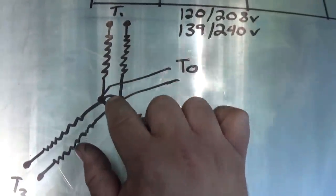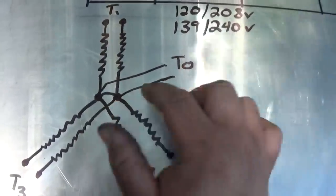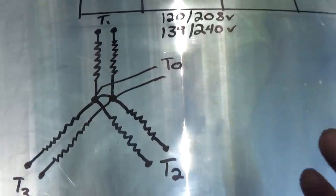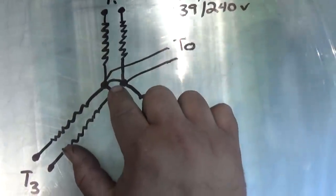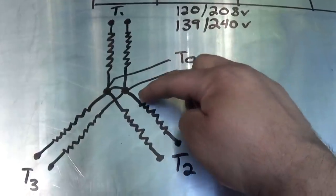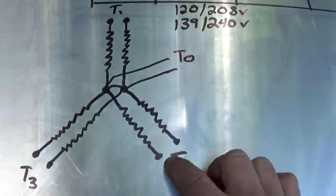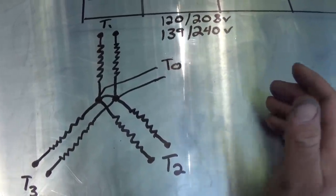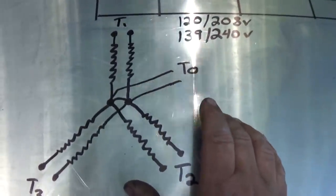And then there also is a bridge between those two points. That is also made permanently in the stator, so it's really not serviceable. You could take the generator end apart, and I'm sure you could find that point, and if you were determined, you could separate them and then pull the ends of these windings out to the connections box, and then you could have yourself a 12-wire generator end, and it could be reconnected. But for all intents and purposes, this unit right now is not reconnectable.